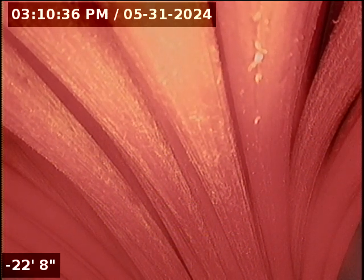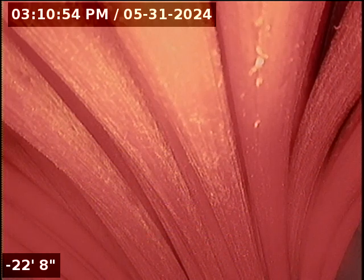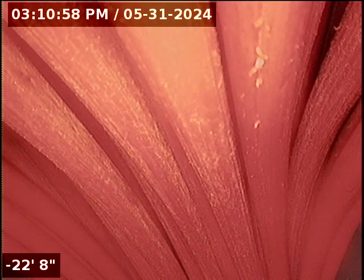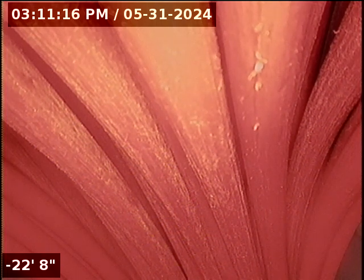I sometimes am pleasantly surprised, but if we've already got roots at this point where there's hardly any trees around, once we start venturing into the heavily wooded area, that's generally what you're going to see. So that's why I say at this juncture, seeing what the concrete looks like, most likely the remainder of it out to the main lateral — unless any parts have been updated — are going to look at least like what we've seen here, if not worse. In my opinion, I think it makes more sense to just get a repair company out here to start doing bids on that; they can start gaining access and doing the locates they need to. You've got two root intrusions and at least two significantly separated pipe joints in the line, and the concrete pipe is just worn out.